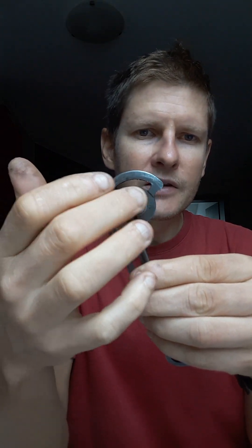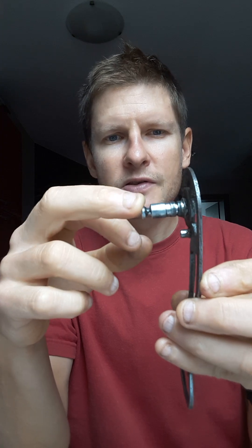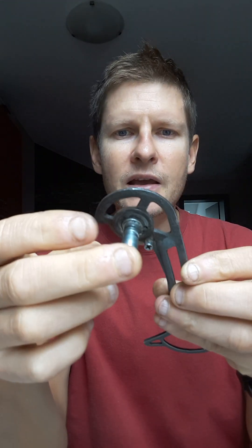Here's how we fix it: we grind it off, make a new one from hardened steel, do heat treatment, then press it back inside using a special tool — about one to two tons of press — to deform and secure this area. We only harden that specific area.